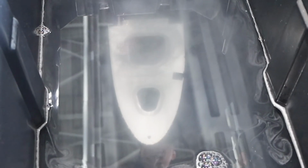But this stuff is really, really easy to clean. It's all brand new. So as you can see, it's kind of smoking in there as the little bubbles come up. It's going through the process, and you need to leave this in the etching solution for 2 to 5 minutes, and it will do the trick.